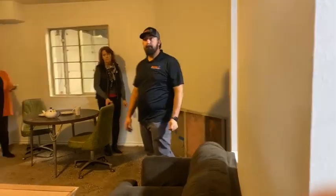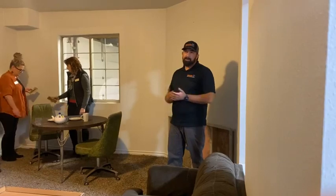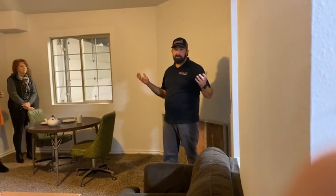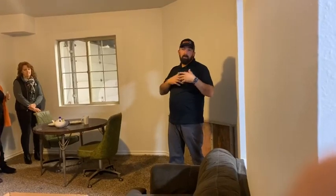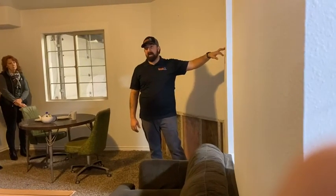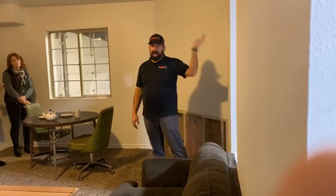What do you do when you get up in the attic? How do you clean that? So a couple things happen when you start getting into attics. As long as the trusses are in good shape, which we'll usually pull an engineering report to determine the structural integrity of the place, then we'll usually go in there and rip out all of the blown-in insulation. We'll wipe down and HEPA vacuum all of the walls, even the OSB on the top side, and then we'll come back through with a real heavy primer. So almost like a Kilz product. So you're just sealing everything in?